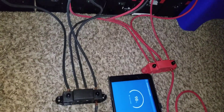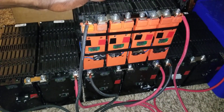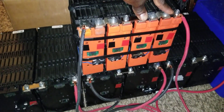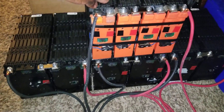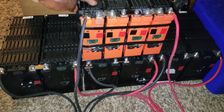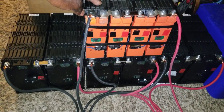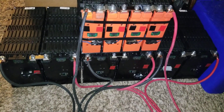You have to make sure when you parallel batteries you put them on a bus bar so they work correctly. Inside the car, the e-golf strings three modules and then adds the small ones to reach the complete voltage needed — that's how it's designed. I bought two extra small modules so I can run 60V into my Outback for the 48V system. The Outback MX 3048 MT can take it, and putting them all together gives about 66–67V, but I was running it at about 60–65V.